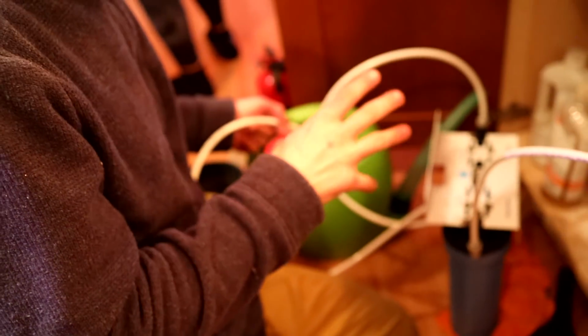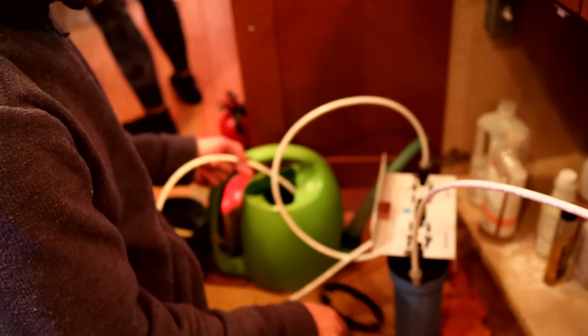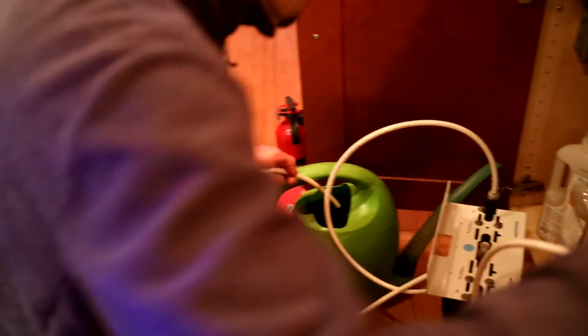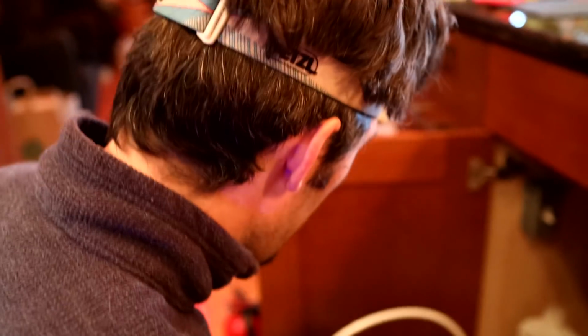All right guys, so I had to go to Home Depot to buy a compression fitting adapter. I'll show you what that looks like. But now what we're doing is, as the instructions recommend, when you put your filters on, you have to use this tool to tighten the filters. Very important to get them really tight. There's water leaking everywhere. We're running some water through the filter. Let me turn this off. Okay, so now we're just running water through the filters, kind of a pre-filter. I'll water some plants with this. I'm sure it's fine.